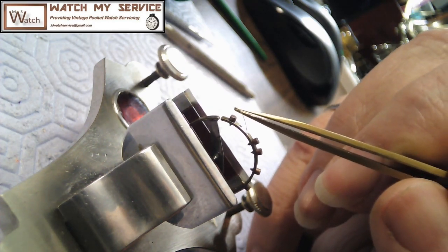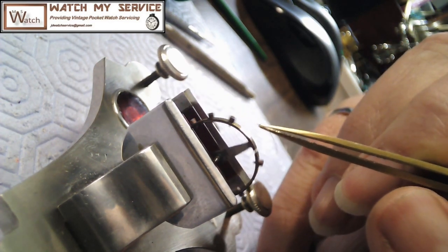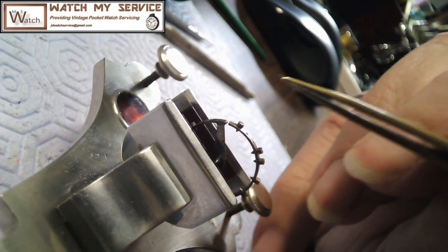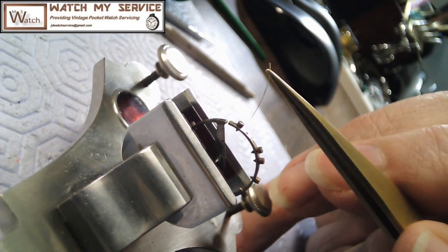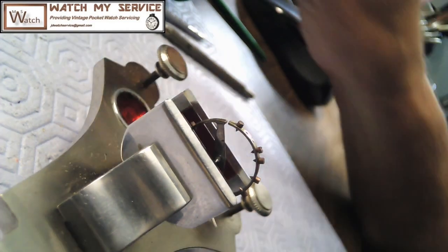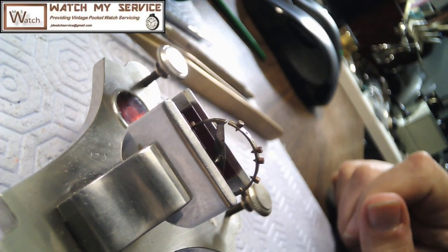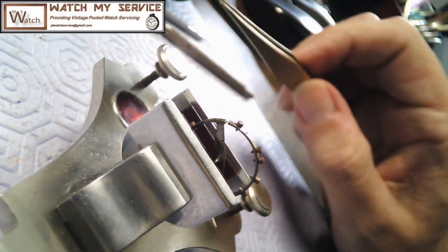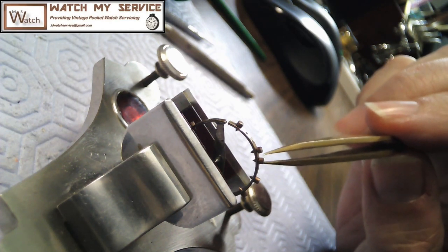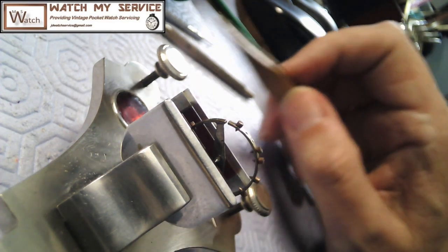It's not stopping in the same place each time now - well, there it is stopping right there again. If I look at this top screw that's the one with the timing washer in it. I added the timing washer to that one and it's not as bad as it was, as you can see. But it would still require a little more weight because you can still see it wanting to fall down to that position. I would basically have to add probably another timing washer to this side - maybe a four-minute timing washer - and pull it down. So you're playing with this. I could undercut the bottom screw a bit more, or take that one out and add a four-minute timing washer, and that would probably bring it around.